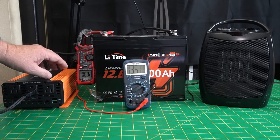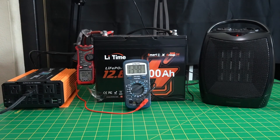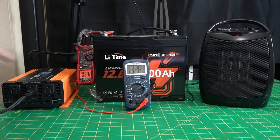I've got an amp meter and a voltage meter — this one also shows watts. Let me turn this on. It's working. We've got a light on the inverter. Running the fan first: we're at 13.48 volts, 2.9 amps, 25 watts. Now kicking it up to setting number one — the 700-800 watt range. It's about 850 watts and settling. Voltage is down to 12.81.